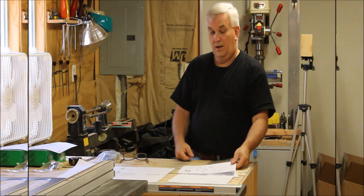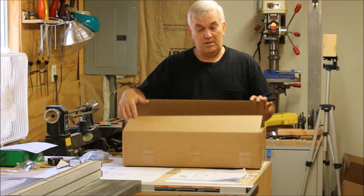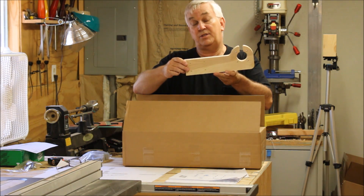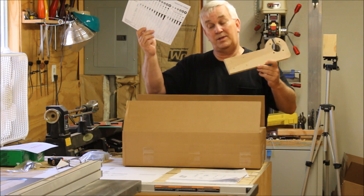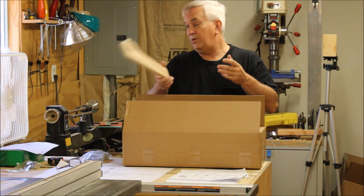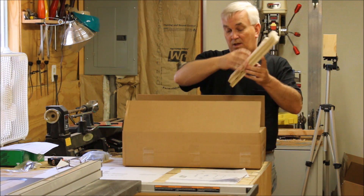For those of you who may not want to take the time to cut all the paper, you can order a pre-cut set of parts from me. It'll come in a box with all the parts pre-cut and little marks for suggested hole locations. I also include a screw chart, because this design is easy — you can put it together with wood screws, deck screws, whatever you've got. When you see a little indentation, check your screw chart and drill the appropriate size pilot hole so it's not sloppy.